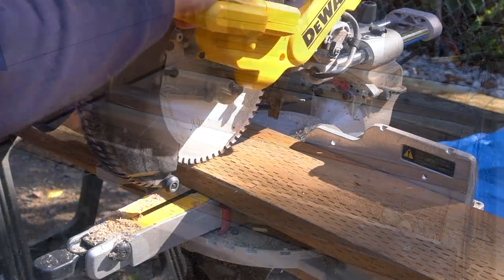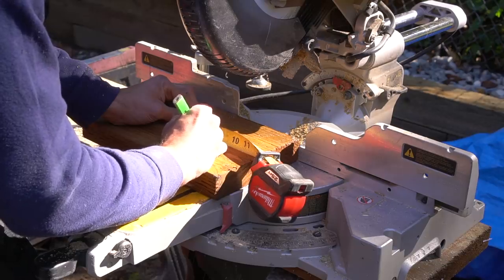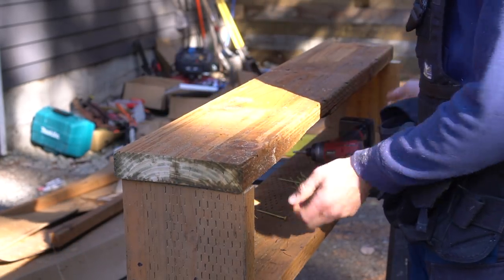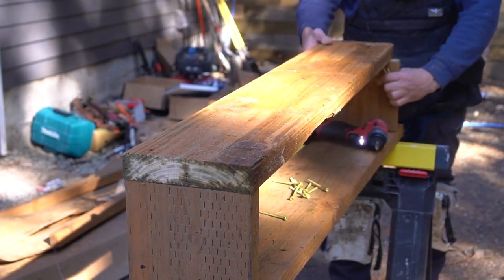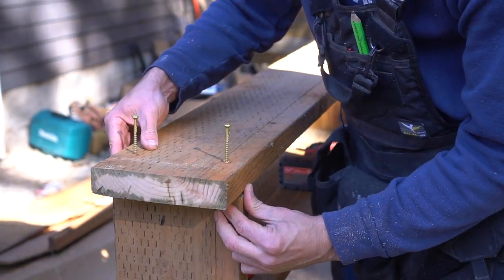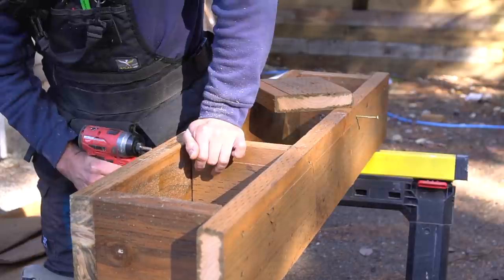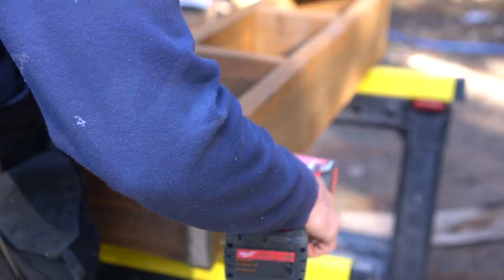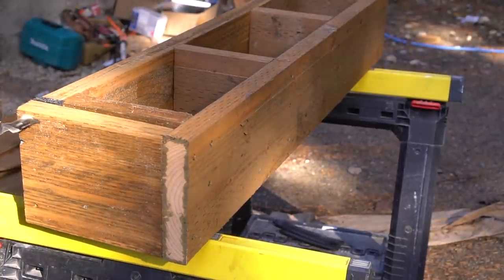With our landing framework taken care of, it's time to proceed to our step. We have to make a step down from the deck to the landing because there's approximately 15 inches of height — way too much, and we don't want anyone busting an ankle. Luckily, using 2x8s at 7.5 inches wide makes a perfect height for this one step. This step and landing are 4 feet wide, matching our retaining wall stairs. However, because we have a railing here, we do have to do some framework and bracing on the sides to properly slide into place underneath the railing.